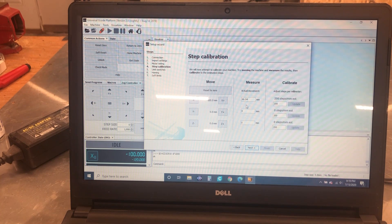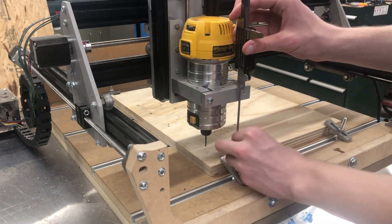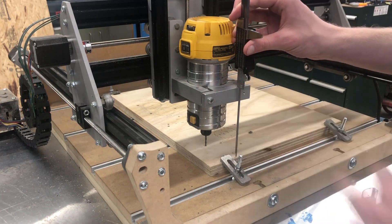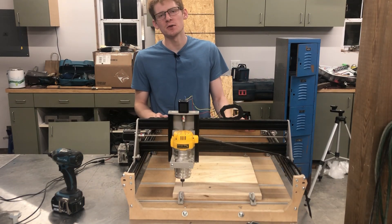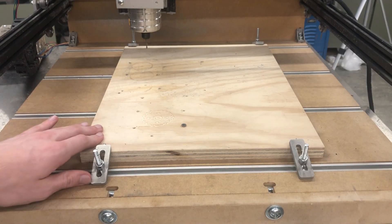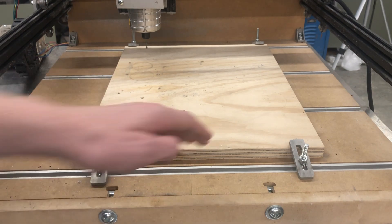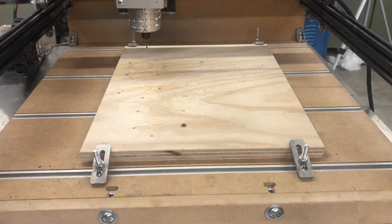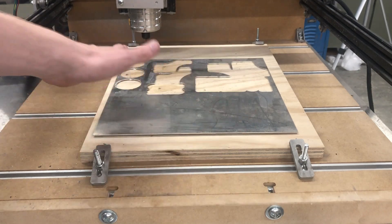I can do the same thing with the Y-axis. Doing the Z-axis is a little easier because it doesn't really take any setup — you can just take normal depth measurements off of some flat area on the Z. Those two things were the big pieces of advice. Now for some smaller rapid-fire tips. Don't try to clamp your material directly to the bed — it's more difficult and you'll just end up damaging it. Instead, clamp a sacrificial piece of plywood to the bed and then screw your material directly down to it. It makes everything easier.